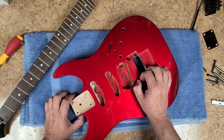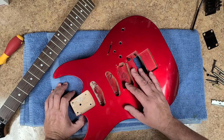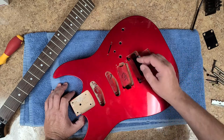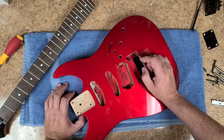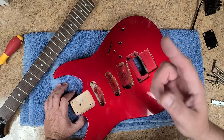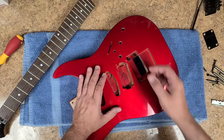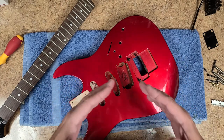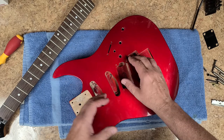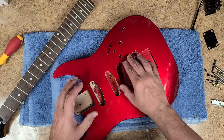What's nice about it too is there's no play in them at all. I was worried those were going to be stripped out. I was worried the wood would be disintegrating inside all these holes for the threads, because there's no sleeves — this is threading through wood. I kind of thought I was going to have to take some wax, put it around the threads of the screw, put some CA glue around the screw itself and thread it in. What that would do — using wood glue — it would not reform the threads but make the threads harder so the screw won't be wiggly anymore. It'll be butted up against the wood threads, and with the wax on the screw I'd be able to turn it with a screwdriver and back it out, leaving the new threads the screw made in the wood with the glue.